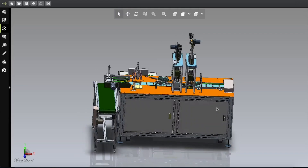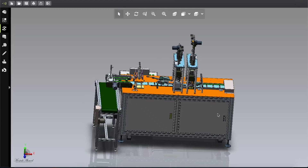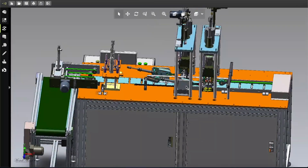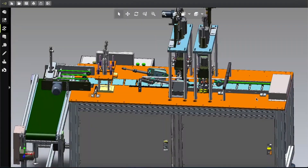This design is simpler than the first generation model, which was a little more complicated and needed more spare parts. This one has a rotatable head that just rotates — one, two, three — and seals the ear loops one by one. There is also a pneumatic cutting unit that automatically cuts the ear loop every second.